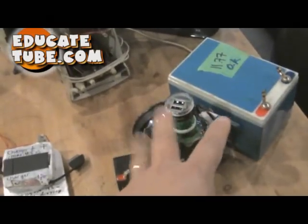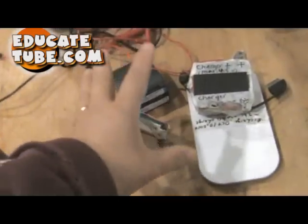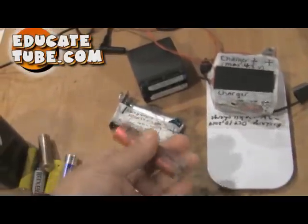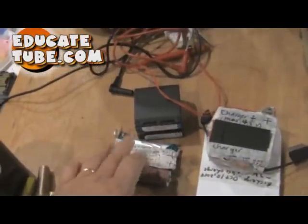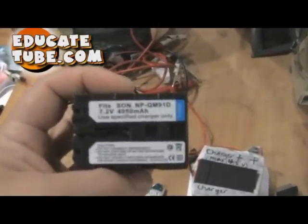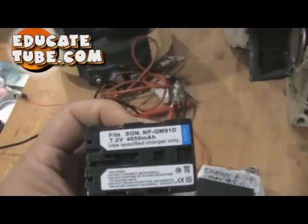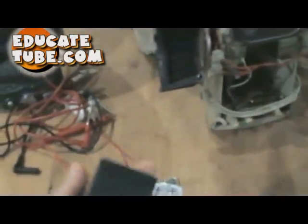It's not just compatible with 6 to 12-volt lead-acid rechargeable batteries — it is also compatible with lithium. This is the lithium from my laptop. Instead of throwing it away, I was able to power my audio system. This is a 3.7 volt; you might have to connect two in series to get 7.4 volts. Or you can use one of these — this is my camera battery, a 7.4-volt, 4,050 milliamp-hour battery. Very powerful — it will give you over 30 watts of power. One of these speakers could last 20 to 30 hours on just this battery alone.